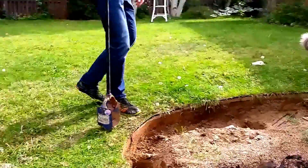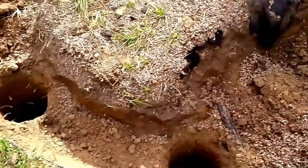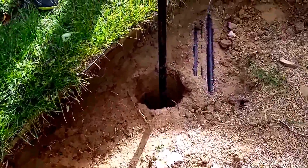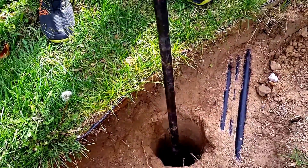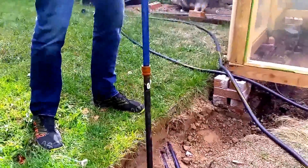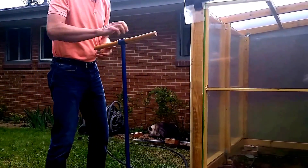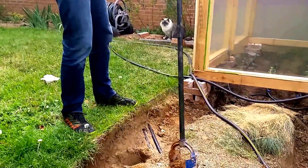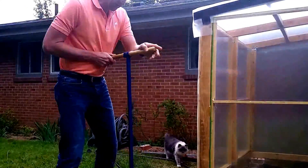You can see the unit is now essentially eight feet long. I've got five holes drilled, and right now they're at four feet. I really recommend drilling these things in parallel. The hardest part is actually changing the pipes. Here I am drilling — just twisting it like this. Pretty easy, actually. You've got the weight of the drill string to help push it down. Pulled up a load — there's some dirt. Stick it down and you just keep going.